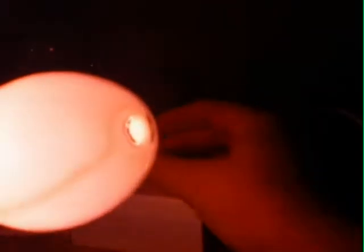OK, I am now going to conduct the small experiment I spoke about earlier. I am now connecting the lamp to the unit via the adapter's lamp holder to the socket. I am running this bulb off that dimmer switch. At first I thought this experiment was never going to work, but it did. Now, that is a pretty colour. Normally it will only stay this colour for a few seconds, but the dimmer switch is preventing the lamp from receiving more power. It is basically an underpowered bulb, although I don't think it is a good idea to do this for too long because it may cause problems to the lamp or cause the arc tube to blacken. Now you can see the arc tube is emitting a blue light.